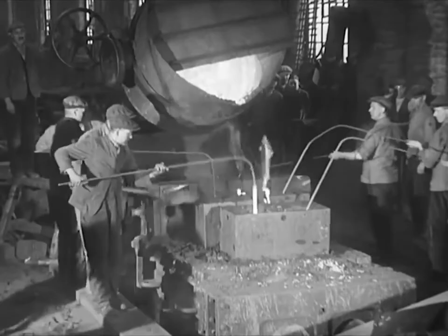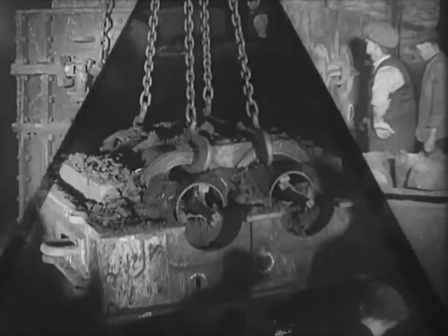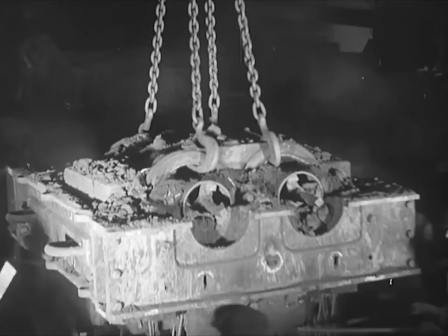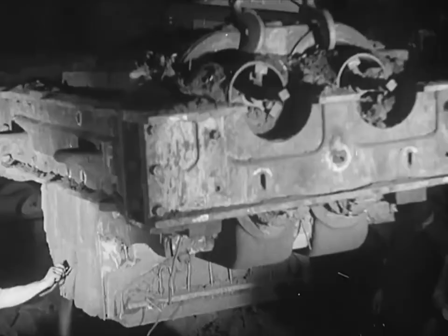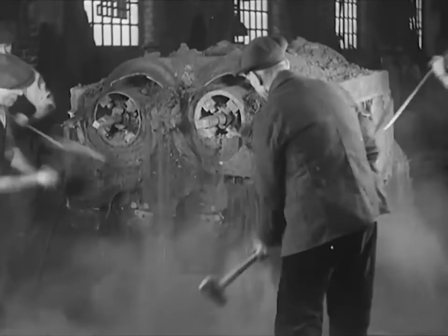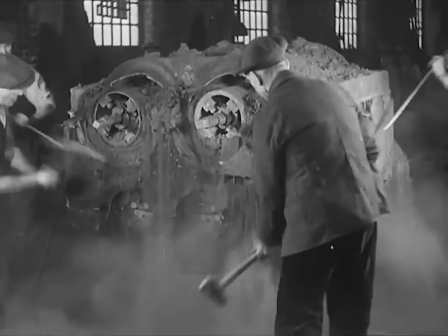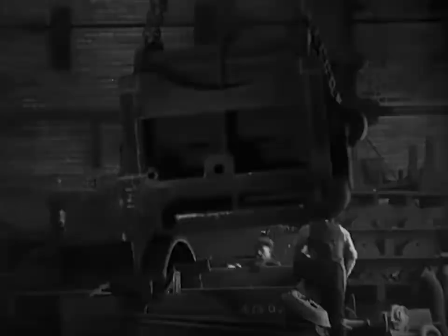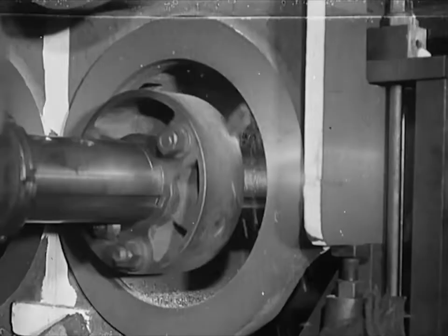One or two days to cool and the mould is ready for breaking open. A crane fixed to the actual cylinders draws them away from the moulding boxes. Men with crowbars break away the sand so carefully and skillfully fashioned by the moulders — pretty hard life, the moulders; all his work seems to end in dust. Leaving the foundry with its glare and dust and smoke, our next port of call is the heavy machine shop, where the cylinders are milled and bored — a tedious but highly important job requiring a high degree of accuracy. Holes are drilled to take the securing down bolts to the saddle in which the smoke box will be fixed.